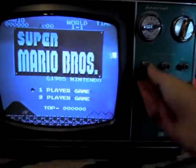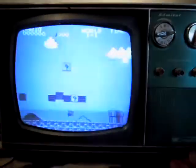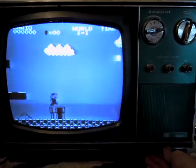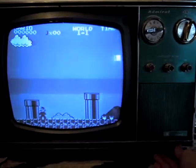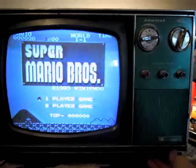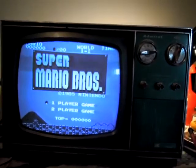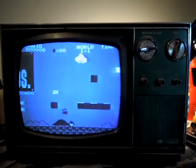This is playable. If we go to our grayscale, I've got really good grayscale and plenty of brightness. I tweaked with the AGC section, so now I have a decent amount of contrast too. It's not going to be a super bright picture — it's only a 22 kilovolt system, as opposed to a modern set which would have 35 to 40 kV. And the regulation on this is kind of poor; there's no shunt regulator or anything. They just monitor current feedback from the high voltage supply.